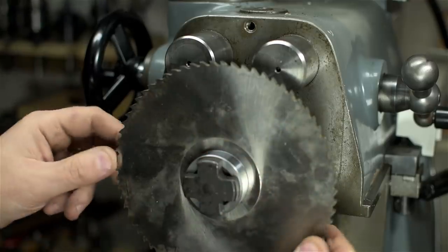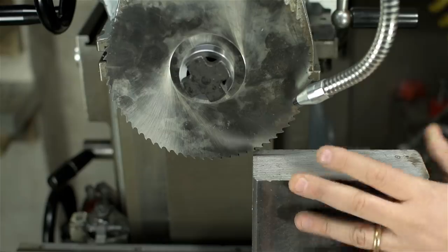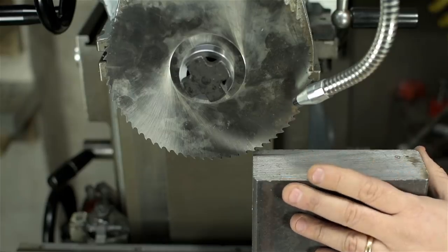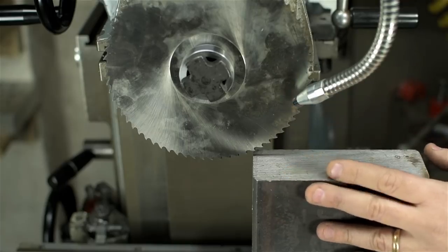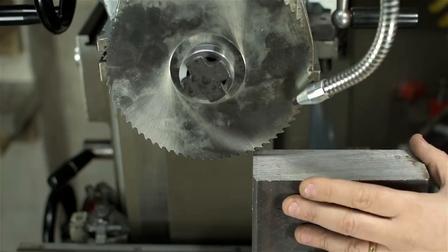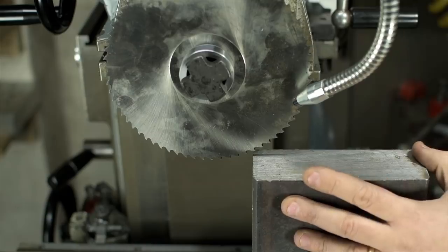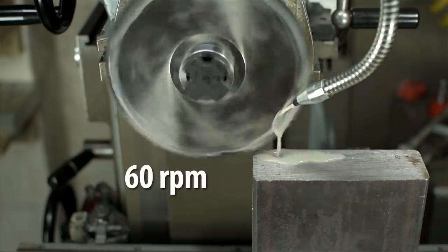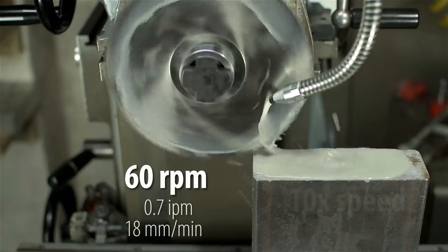And that should be in the right direction. That load on the saw tends to tighten that bolt. I'd be lying to you if I didn't tell you I was a little bit nervous. It's high-speed steel. We'll be running it with coolant. I'm going to do a first pass of only about a 1/4 inch depth of cut, 5-6 millimeters, somewhere in there, just to see how the setup behaves. Then we'll come back and try four times that saw thickness. Here goes nothing.